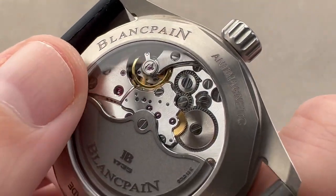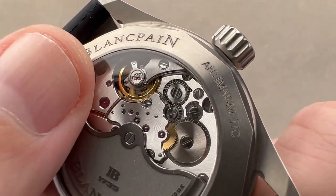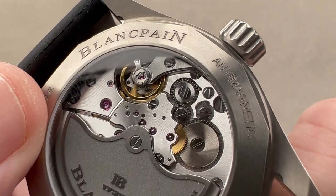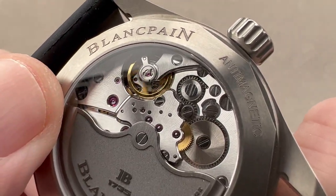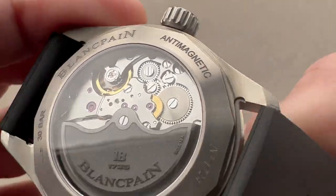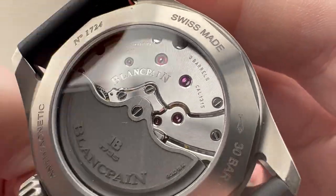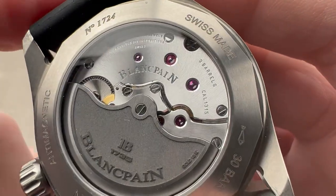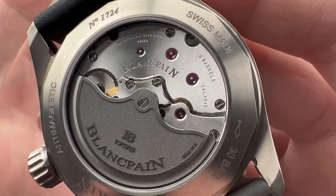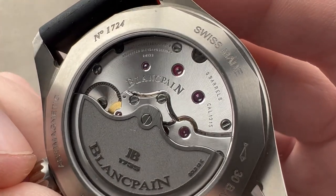It's also tough. It's based on the 13RO, which is a manual wind, but it's automatic winding. Free sprung, adjusted in six positions, which is one more than the chronometer standard of five. The free-sprung architecture makes for very precise adjustment but also shock tolerance. And we have an anti-magnetic silicon hairspring. The watch features 35 pivot jewels. It includes three barrels faced such that the watch doesn't gallop and gain time when fully wound, or lose tons of time when it starts to wind down — that's one of the advantages of having those barrels in series.